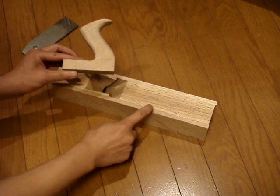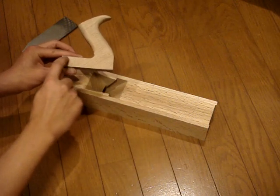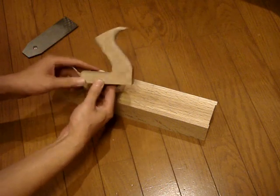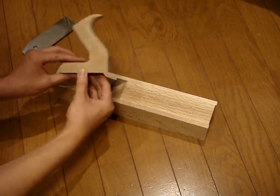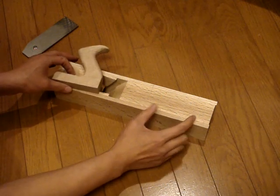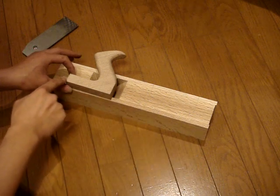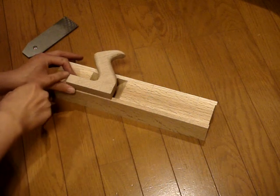When you chop or drill, make sure you don't go too far below the line. I'd recommend keeping maybe one to two millimeters of the top surface proud, because then later you can just pare that down and make it flush. Another tip is to make the mortise length a little bit shorter than the actual length of your tote, because it's easier to shave just a couple of shavings off.